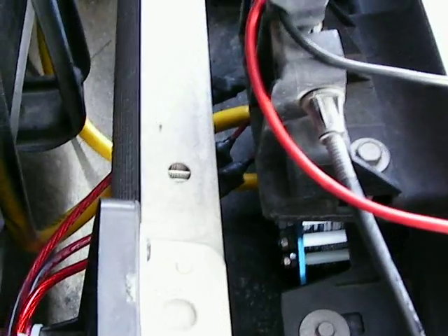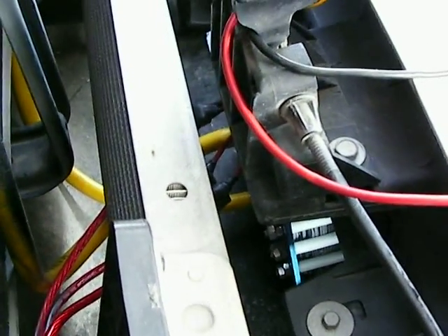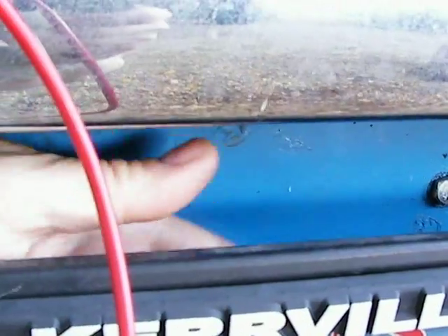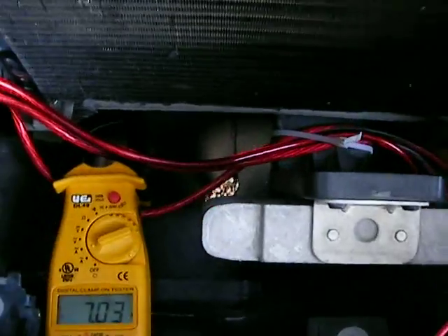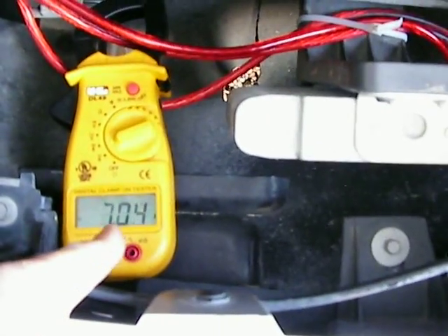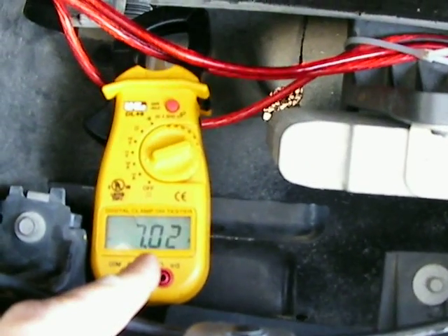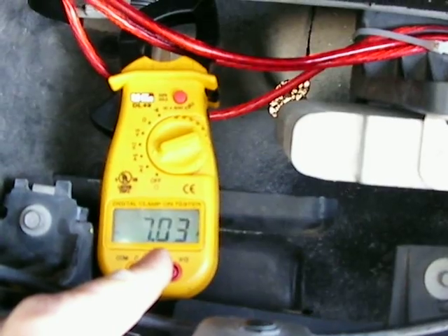What's happening is I have — as you've seen on my videos — an inlet and an outlet on one side of the cell. There's like a front side where the water goes in the front. And then this side here, which is the back side, you can see there are no fittings on here. What I discovered, because we ran these two relays, is that the side that does not have the fittings is at low amperage. My theory is that the back side of the cell is not getting any electrolyte.